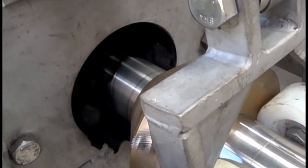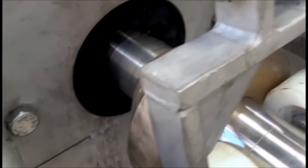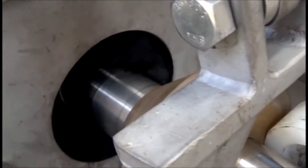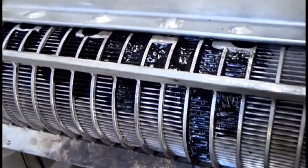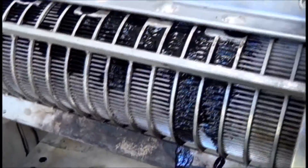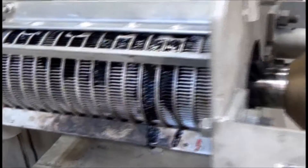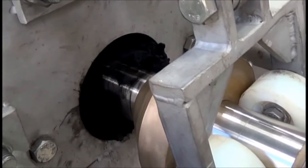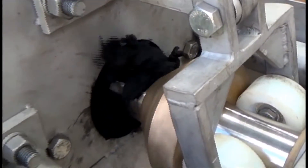We just need to keep it coming like this. If it keeps coming, keep throwing stuff in — you're throwing almost half the inlet hopper. We're squeezing as we cut up the sponge. We're getting some ink out. I'm on the side where the resistor keys are located. The best action is in front of the resistor keys where there's some shearing and cutting going on. I'll give it another couple of minutes running this way to make sure it doesn't plug up.